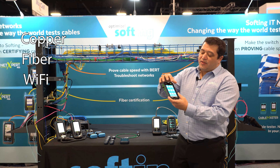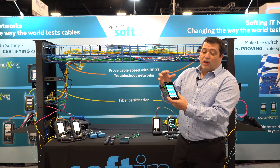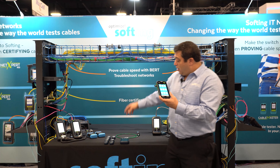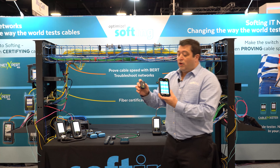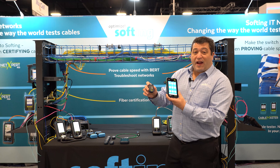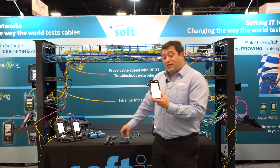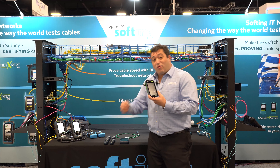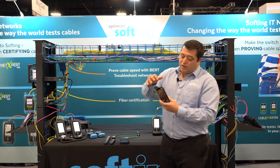The tool set on this is fantastic. You have the ability to do cable testing to the remote. There's a numbered set of target remotes, so it will give you an indication on each of the four pairs and the shield. It will also tell you the number that you're connected to — you're getting feedback from the remote side as well when you're doing this testing.